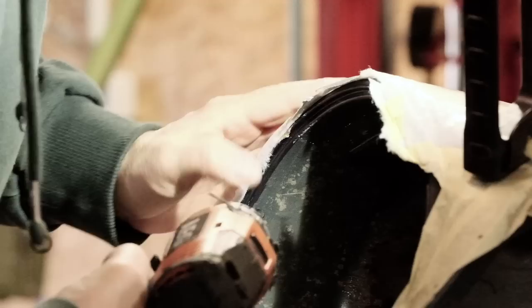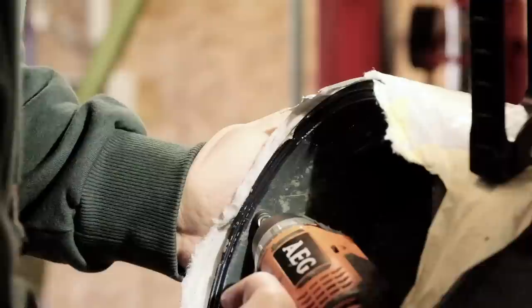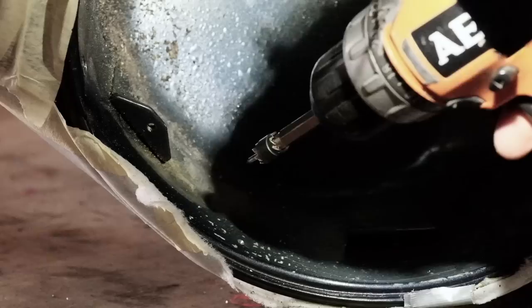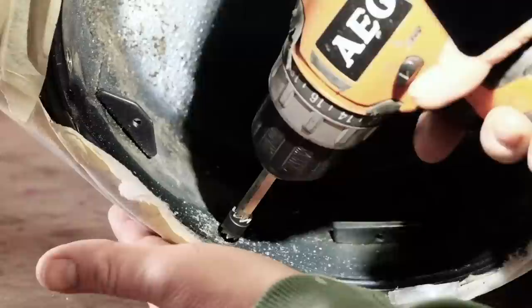It's very bad. The pot is welded to the fender with about a dozen spots that need to be drilled out. I use a spot weld cutter for this. The latch the pot is connected to, however, is not very big, so I made sure I get the cutter centered properly using my automatic punch and by making a guide bore before the cutter was applied. It would be best, of course, to only cut through the pot and not the latch, but that is easier said than done, as space is too tight to keep the cutter perpendicular to the surface.